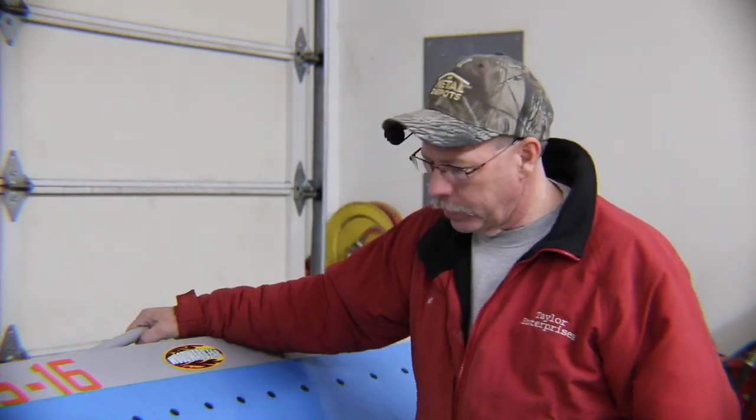I usually, when I order a full sheet of sheet metal, I don't typically have them leave it in 4x8 or 4x9 fashion. I usually have them shear it down. If I'm buying a full sheet, a lot of times I need a particular size, and so I have them go ahead and shear that down for me. And then I have whatever's left sheared down into 2x4 pieces to make them more manageable. And my shears, as far as equipment, the biggest thing I can handle is 4 feet anyway. So having a 4x8 sheet of sheet metal laying around is really just kind of excessive.